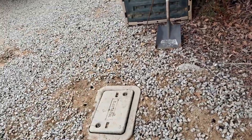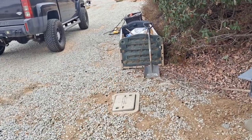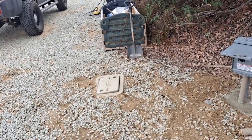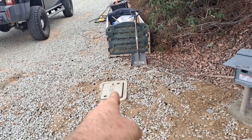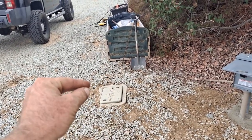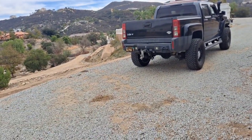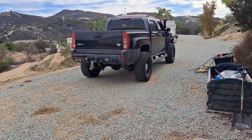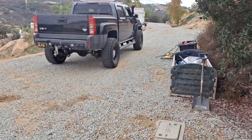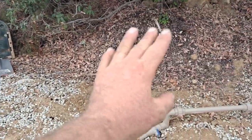So I got really good current coming through here. But the thing is, because that's fused at the house as 100 amp, I couldn't tap into that directly unless I was going to have it continue to be the same size wire all the way down to the pump, which is insane because that's another 400 feet. And that wire over a year ago was over $5,000. So what I did was, with the 3-knuckle boom, pulled it over here into this panel.